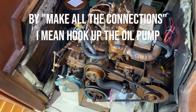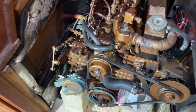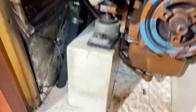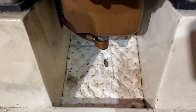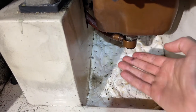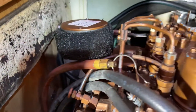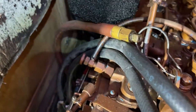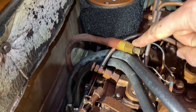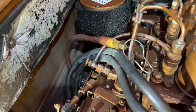If you've changed oil on a car this is going to be pretty similar, except that you can't really get under the engine. Here's the oil pan down here, and where a regular engine you would just put a pan under here, instead we have this tube which goes around here. Right now it's just clipped off up here, and we're actually going to put our oil extractor tube into here — that's how we're going to get the oil out of the engine. We don't have gravity to help us like you would in a car.